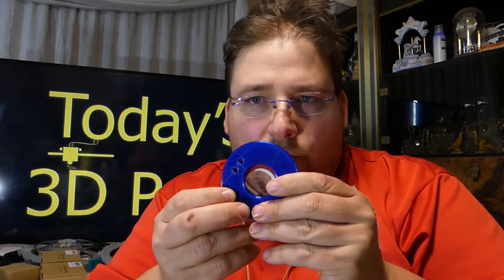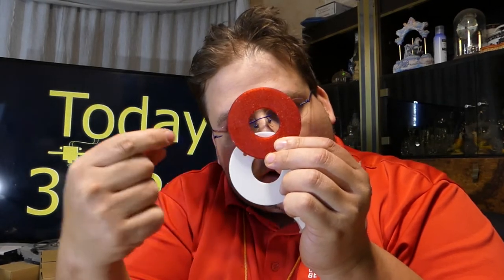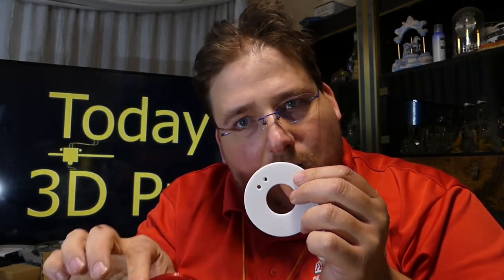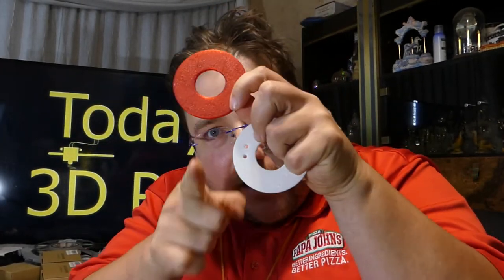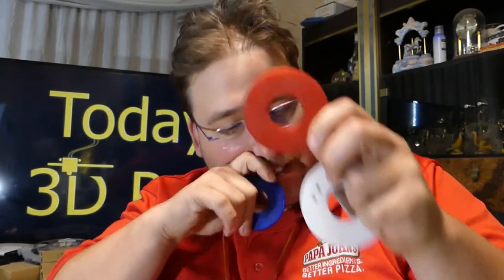Now, when you go to print an arc, here's your vertical wall. When you go to print an arc, you have to shift this layer one direction over, but you cannot lift it up or down. Remember, your layer height is defined. It is 0.2 millimeters, no matter where you place this layer. So if I tell you to place it here, you're placing the layer in midair. It's just gonna fall because there's nothing underneath it to catch it. That's where you would either have to have another layer here to catch that first layer, like this, okay? Or you would have to add support, okay?